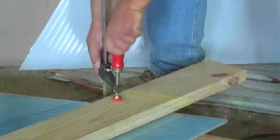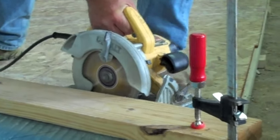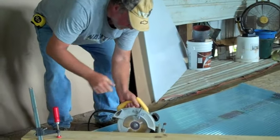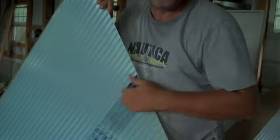It's very important that each edge matches its corresponding strut. Keep in mind that the plastic has to be placed with the UV side up. Be sure to keep track of where you're at while you put the windows in. One of the hardest things to keep in mind is you don't want a triangle sitting on the dome where these are sitting horizontal, because then any condensate that gets trapped in there won't be able to drain out. You've got to look at it mentally to make sure this is going to be a down side so that the condensate will run down.